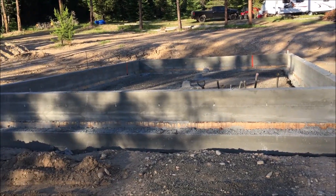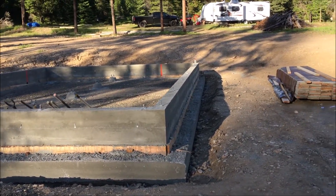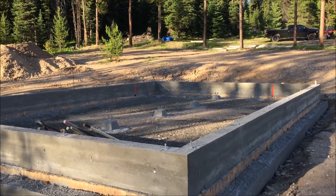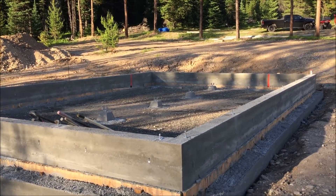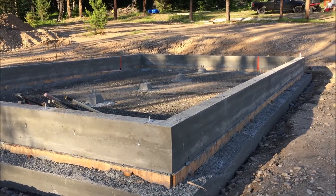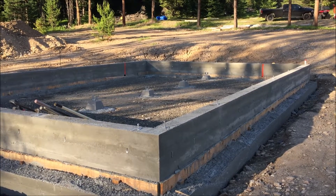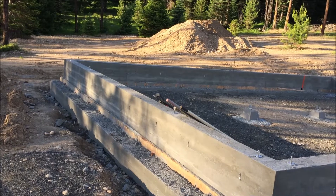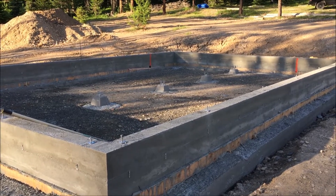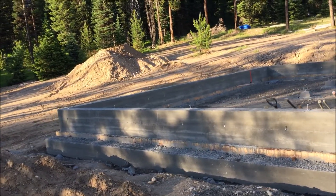It came out really, really well — I'm really happy with it. The cabin is 24x36, and so according to Pythagorean's theorem, it should come out corner to corner at 43 feet 3 and 1/16th of an inch if it's square. These measure exactly 43 feet 3 and 1/16th of an inch — they are perfectly square. I went across, found the center point on each end and each side, and it measures perfectly 24 feet and 36 feet. The stem wall is perfectly square.